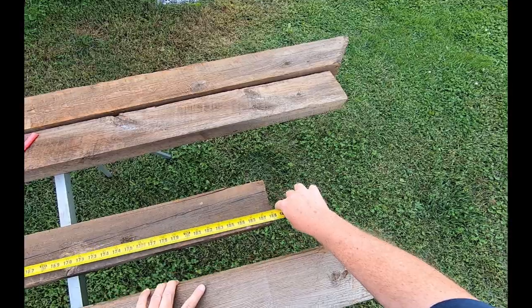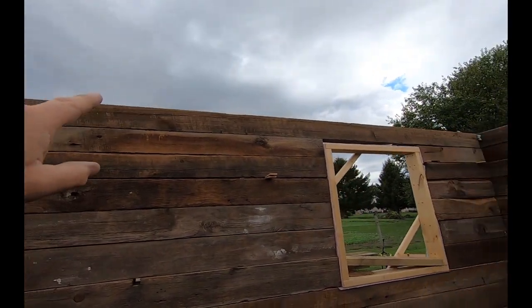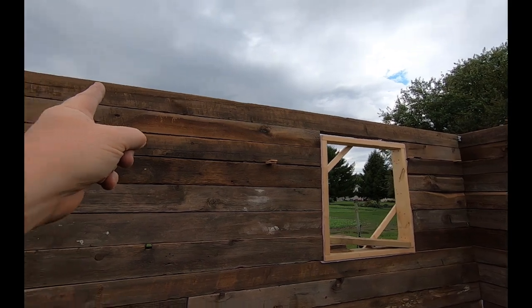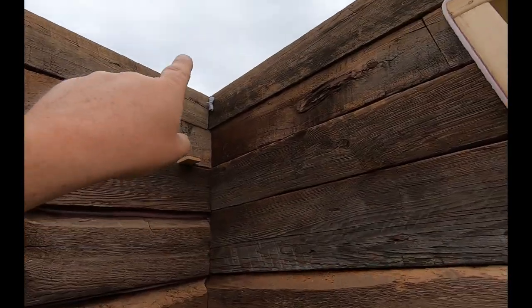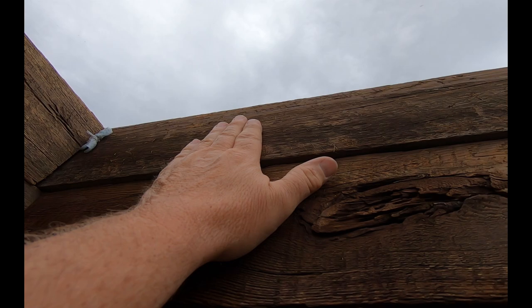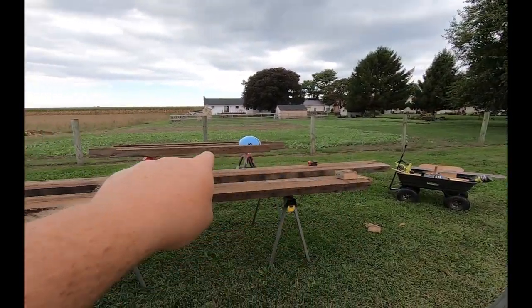Check out the old square head nails. I can get 15 feet 7.5 inches out of the short one. Not only are we dealing with the overhangs with this course, we're also dealing with our floor joists for our loft. Our loft is going to be 7 feet long from back to front. When you walk in the front door, you're going to have a cathedral ceiling up, then a loft going across. We're going to space out four floor joists for the loft — one on the back, attached right to this back wall timber, then evenly divide up three more sections. We'll lay them out on our timbers cut down to 15 feet 7.5 inches.